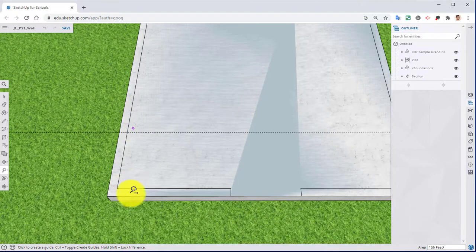At this point, we need to draw the wall around this line. So our overall wall width is 4.5 inches. So we're going to go 2.25 on one side, 2.25 on the other side. On the inside walls, we jumped from 4 inches to 4.5 to mimic both sides of the wall having drywall. So the overall width of the framing was 3.5 inches, 1/2 inch on one side for the drywall, 1/2 inch on the other side. And that's mainly because we are doing interior design for this potting shed. If we were drawing up dimensions to actually build it, we would probably stick with 3.5 inches. That way everything lines up with the construction.